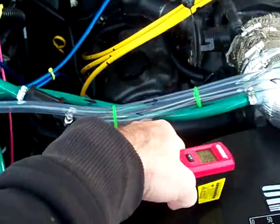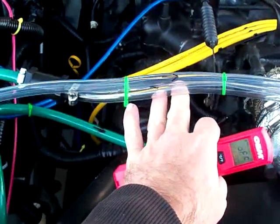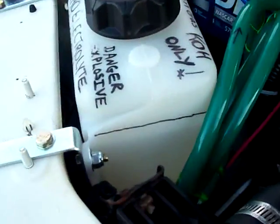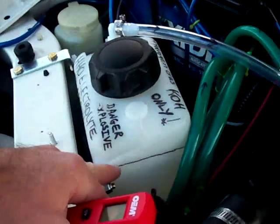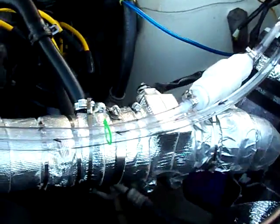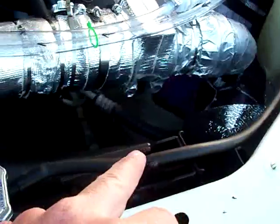I wanted to show here, before I started the system, some potassium hydroxide is back in the line here from the electrolyzer. I'm making it go back in the tank. You can see the level with the electrolyte there. The last time I filled it up, about a day and a half ago — that's where I filled it up to. And this morning it looks like we had no siphoning from the bubbler back this way.